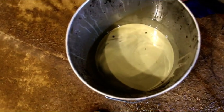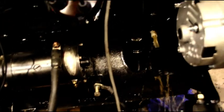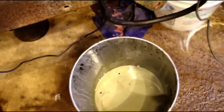Okay Mark, just draining the water and getting this ready for crating. That is what your oil looks like the first time coming out. Now if the second one looks the same way, don't be alarmed — there's a lot of assembly lube in there, and when the oil mixes with the cam lube it looks kind of light. It's not an indication of anything, it's just assembly lube mixing in with the oil.